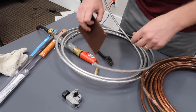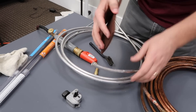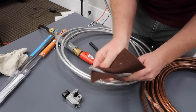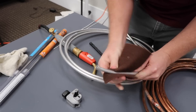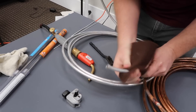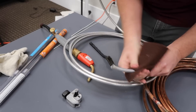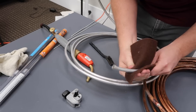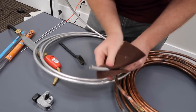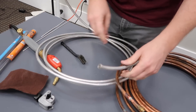The first thing I'm going to do is the part that I'm going to swedge — I want to clean it up real good before I even cut it. I really do like these scotch-brite pads. They're not quite as aggressive and they don't create as many little particles. You do want the aluminum to be nice and clean before you work it.